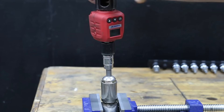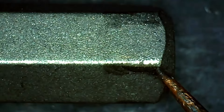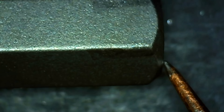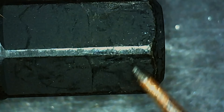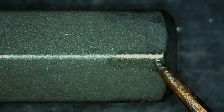The Tekton performed below average in the first round and again here at 1,292 inch pounds, moving into fourth place behind DeWalt, with just a small amount of wear and tear. The Craftsman performed quite a bit better than the Tekton, making it to 1,388 inch pounds with no visible damage. The Nikko Impact performed very well in the first round but gave up early this round at only 1,235 inch pounds — its edges aren't very sharp, reducing contact area with the bolt. The Carbine couldn't get a good grip and let go at 1,310 inch pounds, looking as good as new.